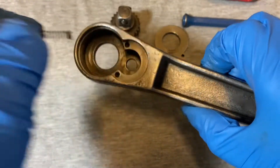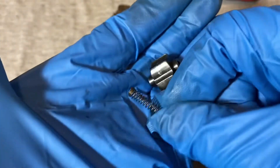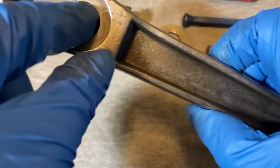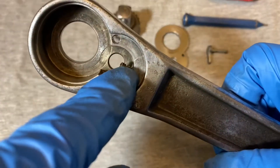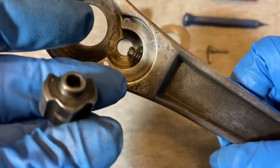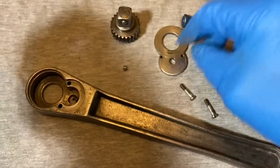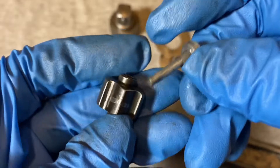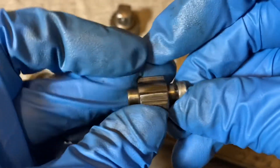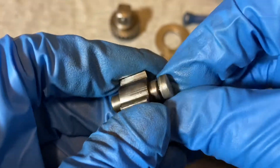The spring is long and pretty big — see how long it is. It's a strong spring too, and when you put it in the hole it sticks up pretty far. So it's kind of hard to get the ball balanced on that and then depress the ball down to get the pawl in. Here is the pawl, and as I said there's a square section that fits into that square section on the switch, and that's how it switches — it catches the pawl and switches back and forth.